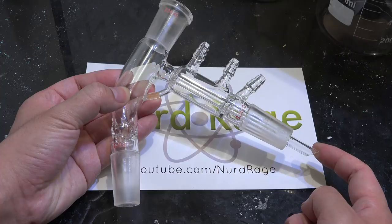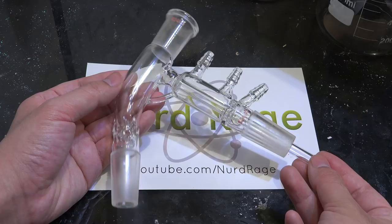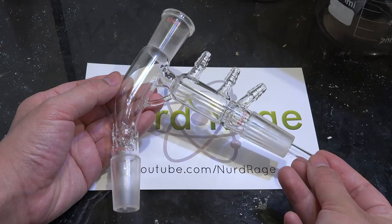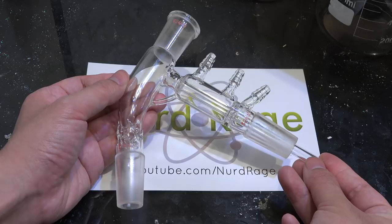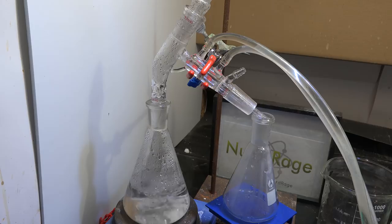All of that being said, you're probably wondering why this isn't more popular. Why isn't this a staple of every lab? Well there are some serious drawbacks and considerations. This apparatus is intended for extremely difficult high boiling substances like essential oils. Such substances distill very slowly so there isn't a need to have a long distillation column — the distillation column is usually very short, it's not meant for high flow. If you try and distill a very easy substance like ether or methanol then it's very easy to exceed the capacity of the column and flood the system with vapor.